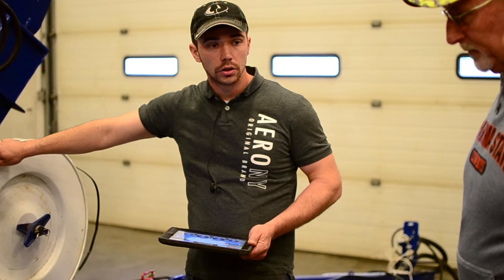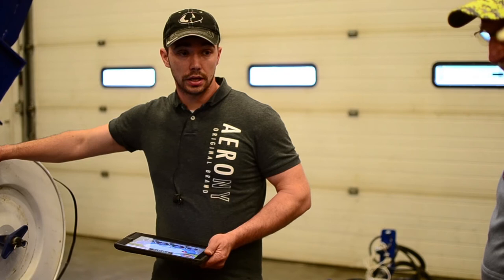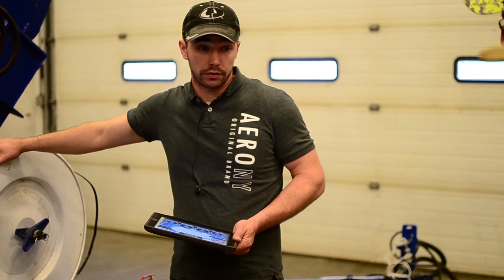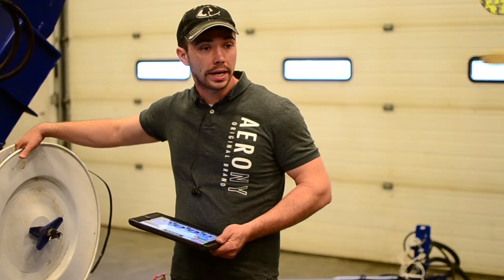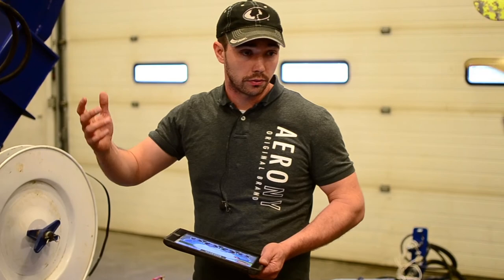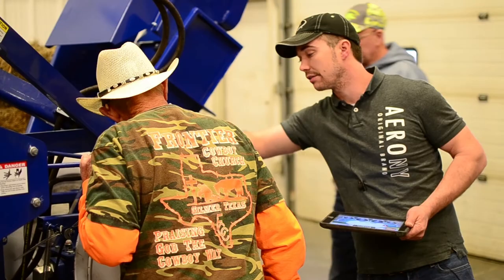At the 122 bundle count you will always have strapping left on the spool. I've never seen it run out before the count. If you look back and can't see the white in the middle you know you've got a couple bundles left. You can actually see how many revolutions are left — if I've got four or five I know I can get another bundle out of it. The strap is wound back-and-forth on the spool.